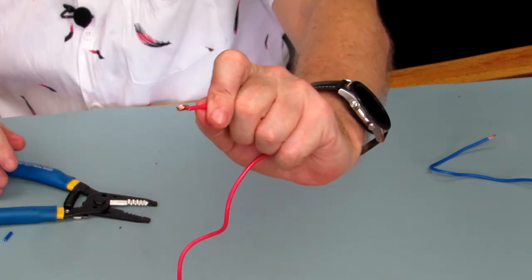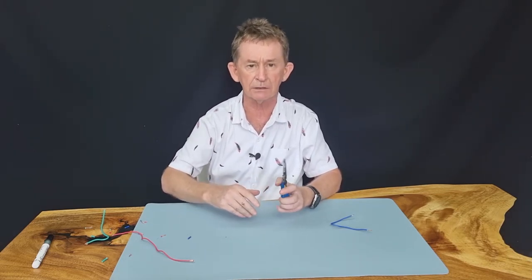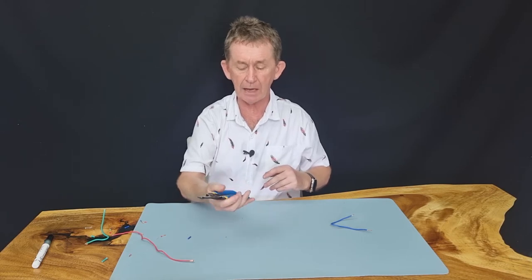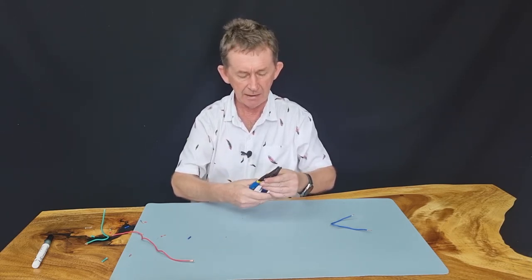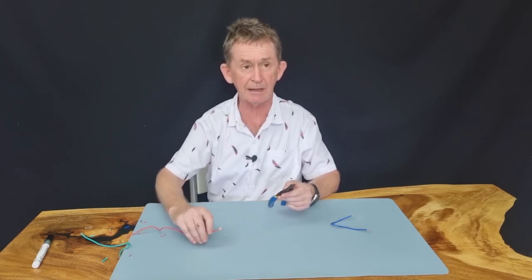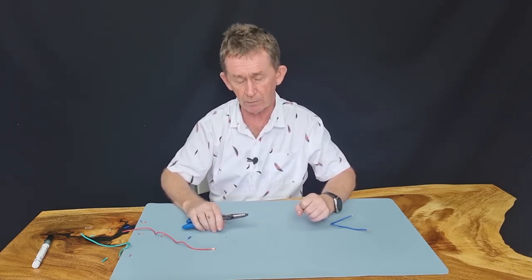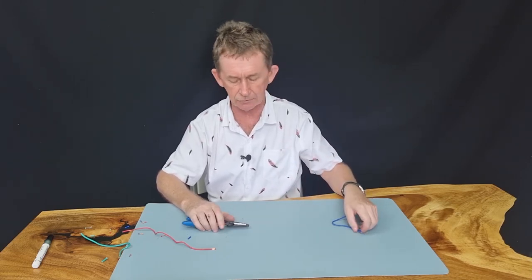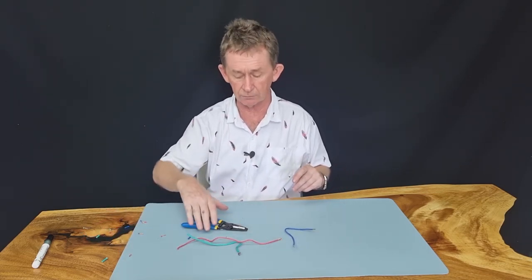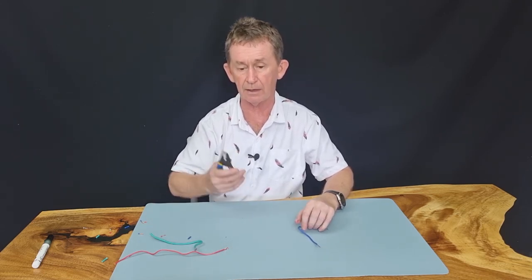So that's my review of the Klein Tools wire cutter and stripper. It comes in blue and it comes in yellow. I like this one — I like the shape of the handle and the rubber is nice and soft. But if you're doing THHN, or other wires that have a sleeve on the outside, you cannot use the fully automatic pull one. You can use the manual one with different settings, but the auto-range one — no. It just drags the outer coat. So for regular wire yes, but for THHN no — that's why you need one of these, or a semi-automatic one.